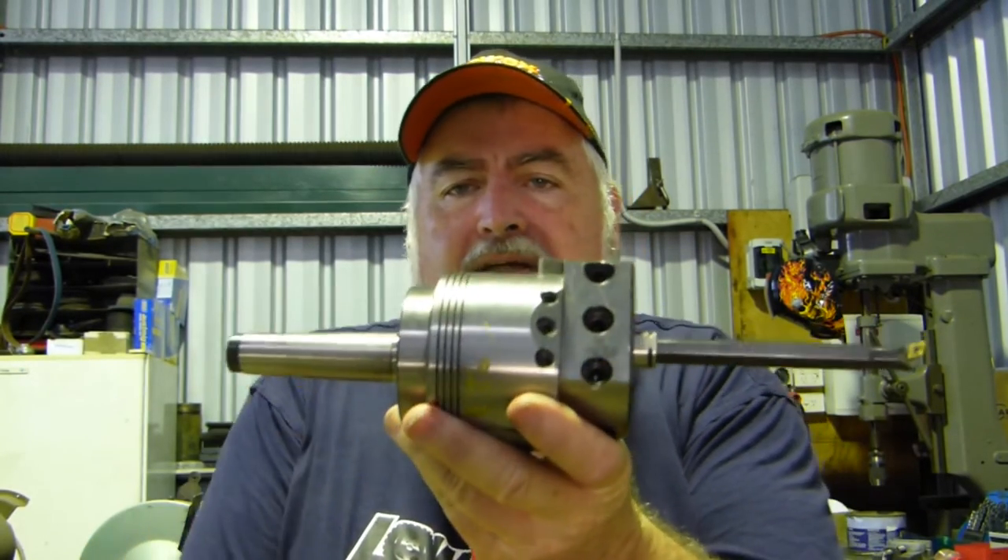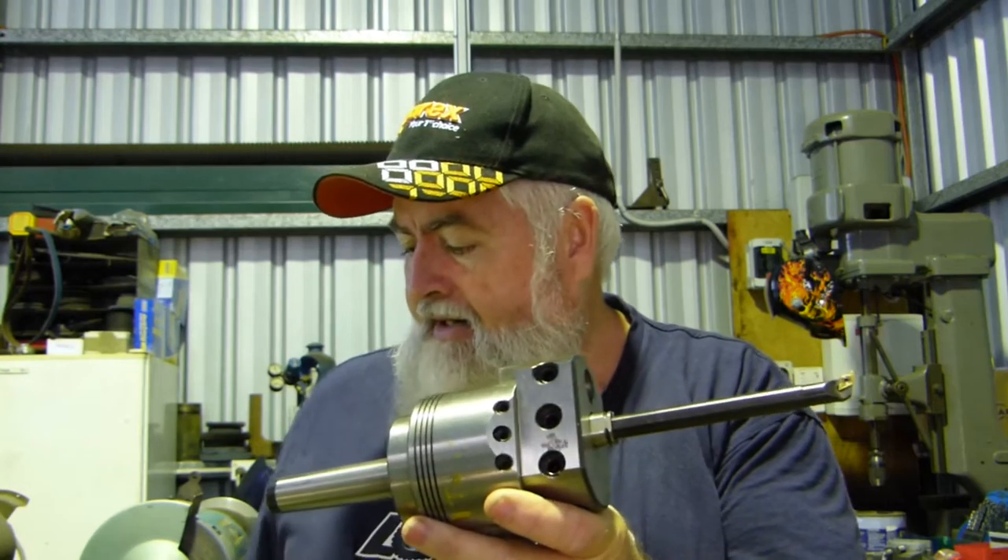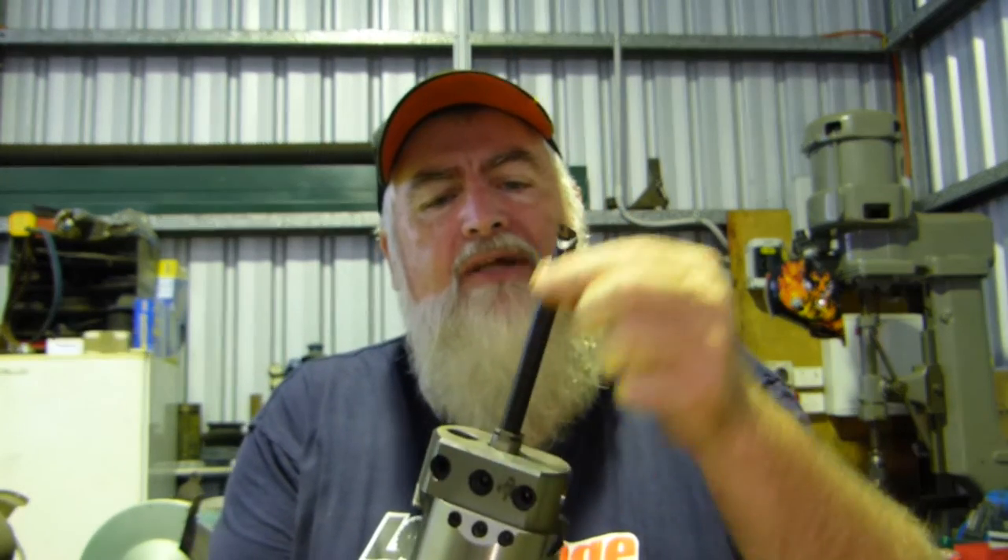We took a couple of photos along the way but didn't take a video — it was just one of those jobs where we were flat out. If you look on my Facebook page, Lance Maskell — M-A-S-K-E-L-L — I put a photo there of boring it. I was using this setup to bore the front axle out and it wasn't ideal; this is too skinny and I was getting a little bit of chatter. But it was nothing we couldn't tidy up with a ream — a couple of nice quiet passes and a ream — and we got it nice in the end. Then we put a steel bush in and bored the bush, making it close to size on the lathe.